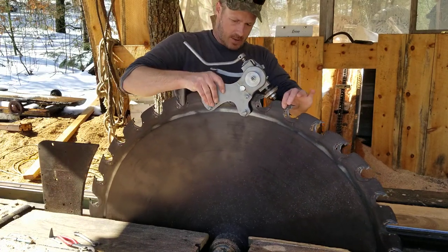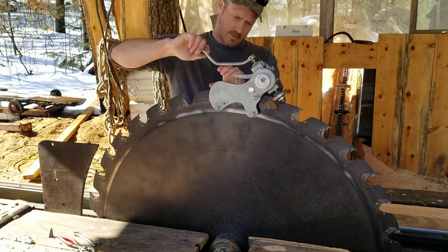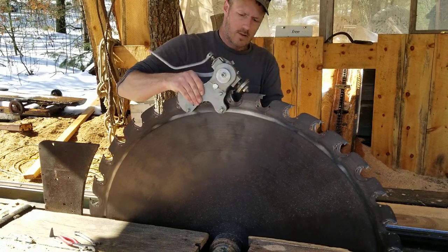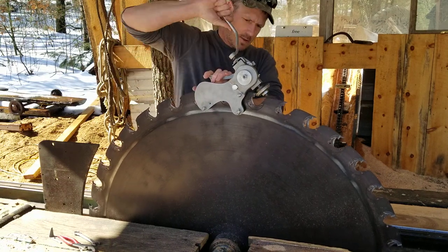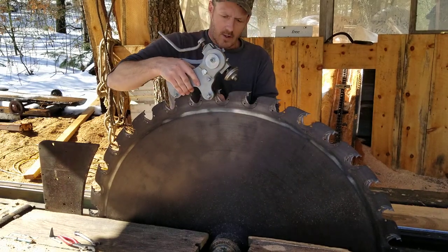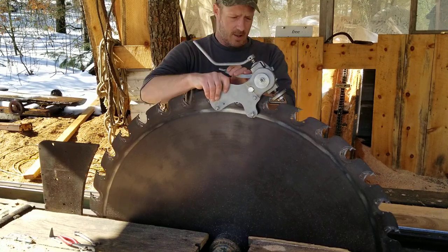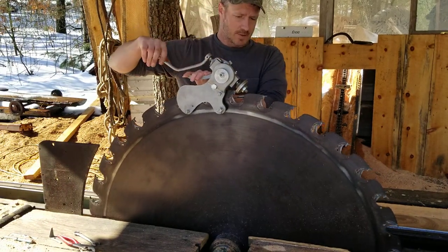Not the best with it, but if you're not good at hand filing it's pretty good. Sometimes I get one more crank than others — that doesn't really matter a whole lot. You don't want to be doing a whole lot more than the other ones though, because that tooth will get small and then it's just pretty much doing nothing.